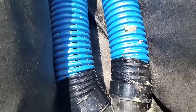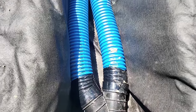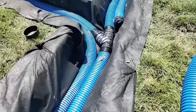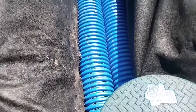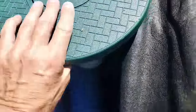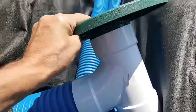You can tie both systems together and they can share the same discharge line — there's nothing wrong with that. By the time all this water makes it to the discharge line, whatever contaminants are floating in that yard drain collection system will get washed right out. The inlets on the French drain system are going to be preserved forever because we isolated the yard drain from the French drain.